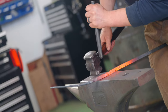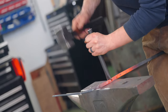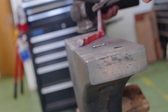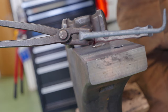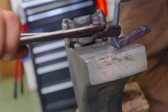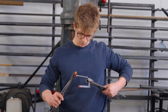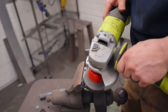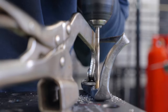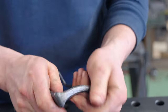Finish it off with a little angled cut instead of a square end. Now you see, there would be a problem if it was just like this, because you wouldn't be able to screw into it or drill the hole. So we're gonna chuck a little bend in there, offset it nicely. A little bit of wax for this too, and it's done.